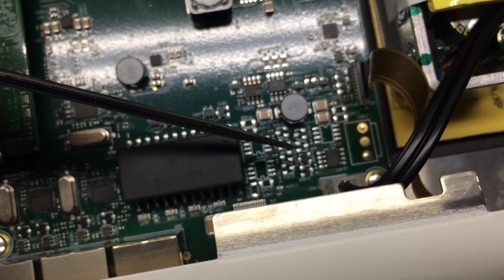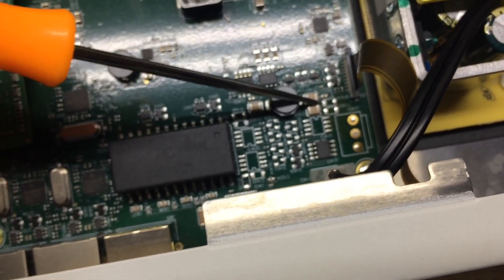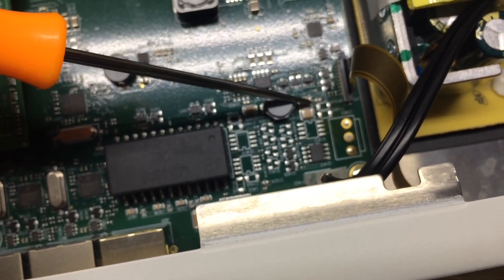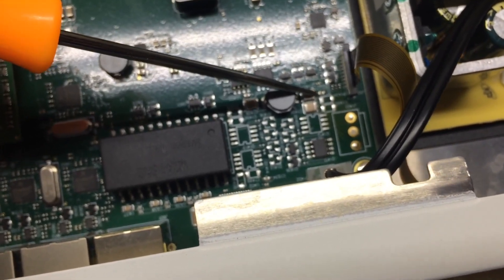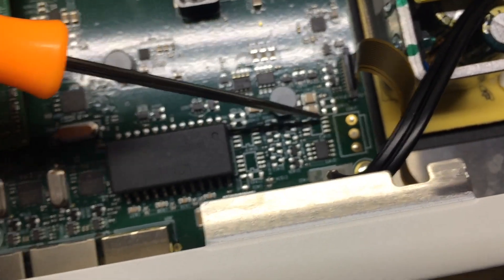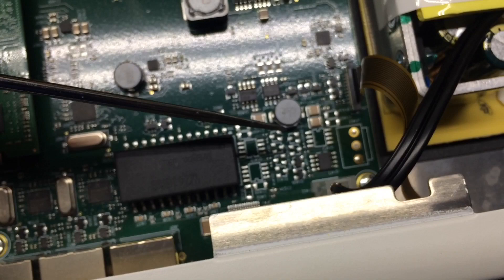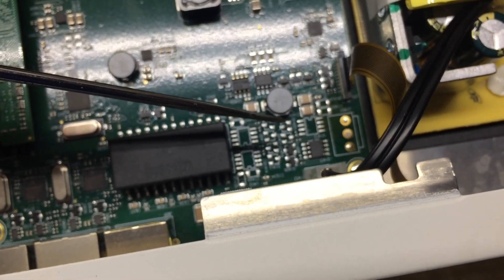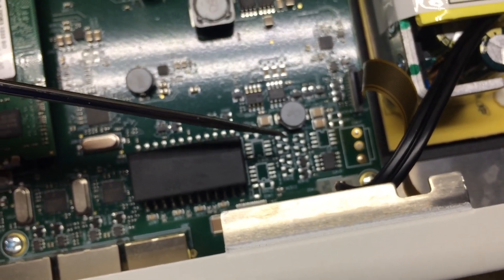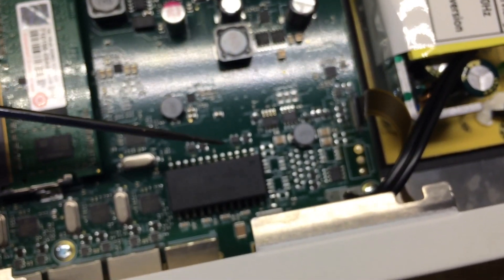I have most of these components. The only thing I'm missing is a 10K surface mount resistor, so I'm just going to use a regular metal film axial and bend that over. I'm going to go ahead and populate all these components on this board, then I'm going to make a little DC whip and penetrate it out the back so we can use these at the towers.